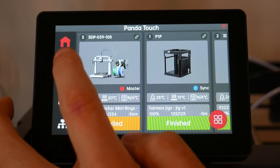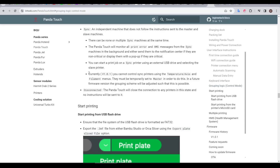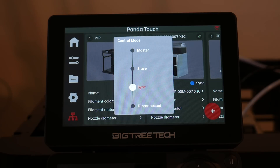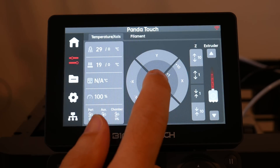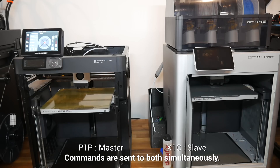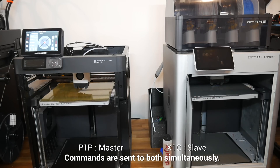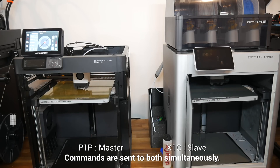The master printer will be listed first on the Home tab, and any manual controls you input will be sent to it and not the others. This method for switching between printers is a little clunky, but according to the online manual it will be addressed in a future firmware update. The most interesting option for print farms is Slave mode, which synchronizes commands between the master and the slave printer. I can demonstrate this by pressing Home in the manual controls — with that single button press, both machines go through their homing sequence simultaneously.